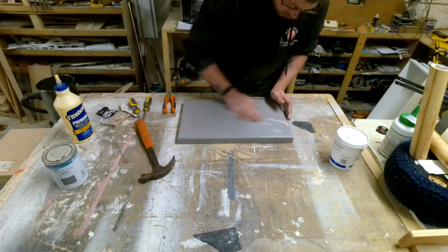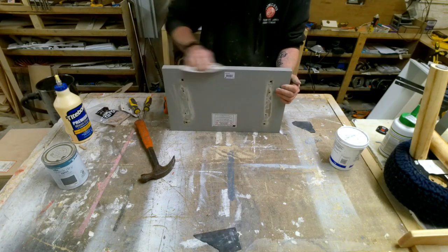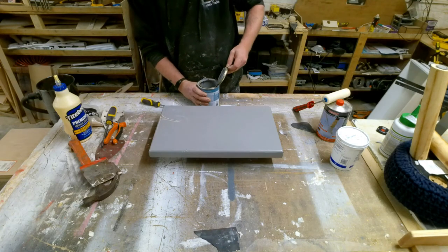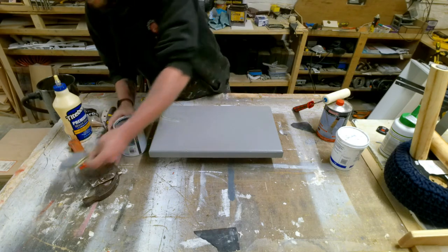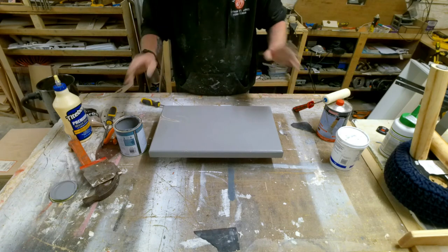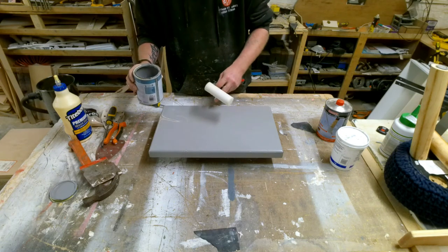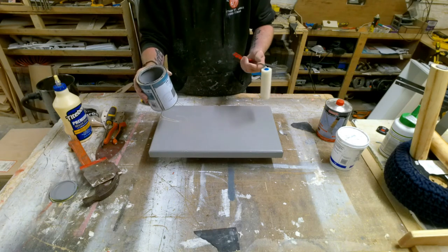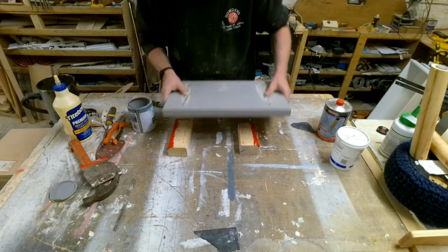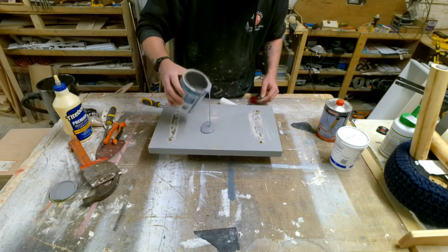I have 120 grit here. When you're repainting anything that's got paint on it, you need to scrub that surface up just to give the paint something to adhere to. This is a pretty good colour match. If it looks really daft I'll sand down the base and repaint that as well, but I'm fairly confident. I should really put this in a tray and roller it, but because we're doing such a small area there's no point getting a tray out — it's oil-based and a nightmare to clean up. So I'm putting a little bit on the surface and rolling it on.